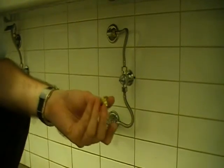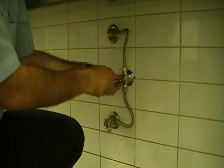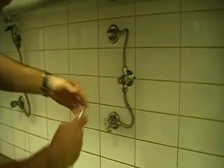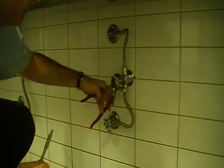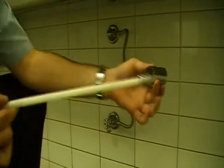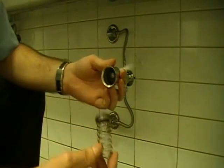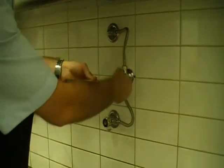Put all those together and place them over the top of the cartridge. By pushing down, you can get the spindle and screw it straight in. If you wish, you can use your pair of multi-grips to make sure it's nice and tight — holding the top of the brass cap itself, not the spring. Once that's done, put the lever back together by grabbing the metal cap and lever and placing it through the end. Get the plastic cap and put it back onto the lever, then put the spring over the cartridge and screw it clockwise.